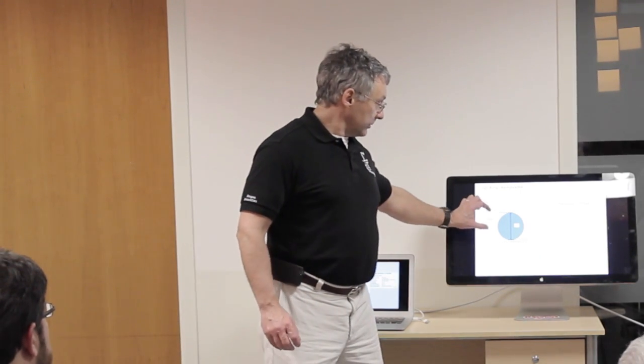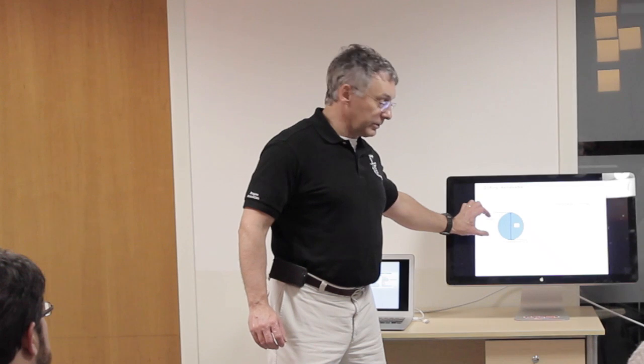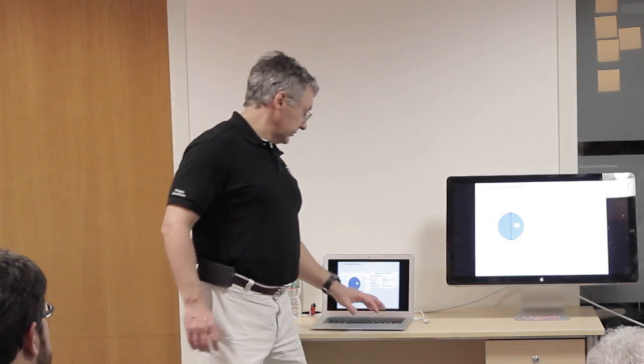You've got a tolerance on the O-ring manufacturer itself, a tolerance on the depth of this hole, and so you've got an assembly where you can't tolerate more than about a thou of variation. So you've got to be able to build this groove and this cover and everything with no more than plus or minus 0.5 thousandths of an inch variation to make this O-ring seal work. O-ring seals are all about tolerances.